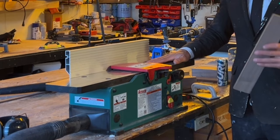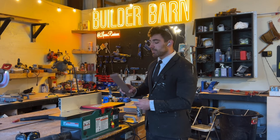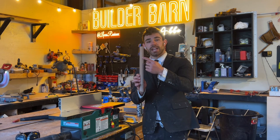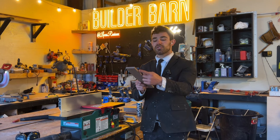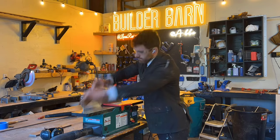Now that all my pieces are cut to 15 inches, we're moving over to the jointer. This tool is very important for making sure all my floor pieces sit perfectly flat. I'm going to run the width side through first, then put that against the fence to get a straight edge, then run it through the table saw — flat end on the saw, straight edge on the fence — cut to width, then move to the planer to take this half inch down to three-eighths of an inch.